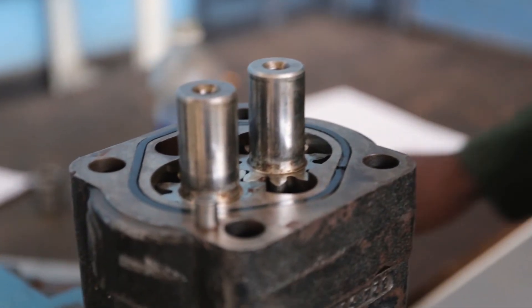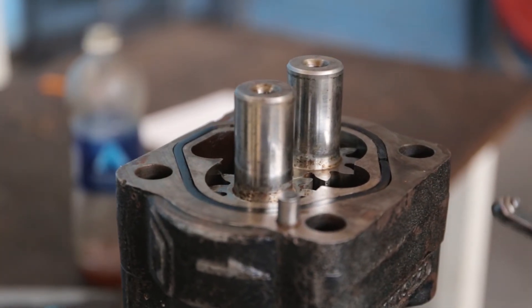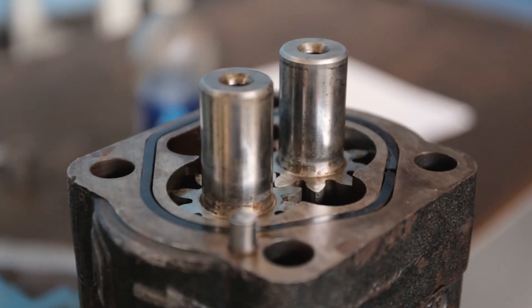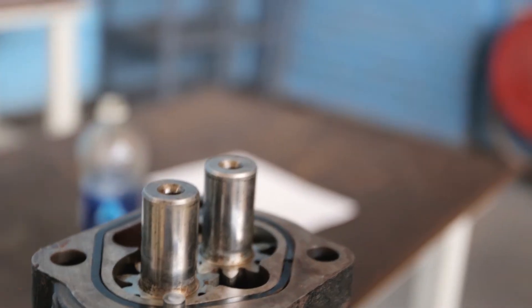But for the gears, according to the visual checks that I'm seeing there, the gears are in good condition and the clearance is also according to what is specified. Those are the checks we are carrying out today on this hydraulic external gear pump, single unit.